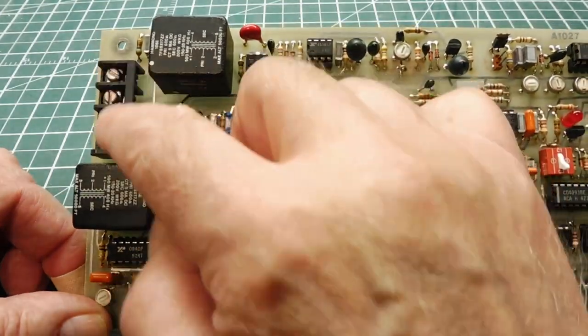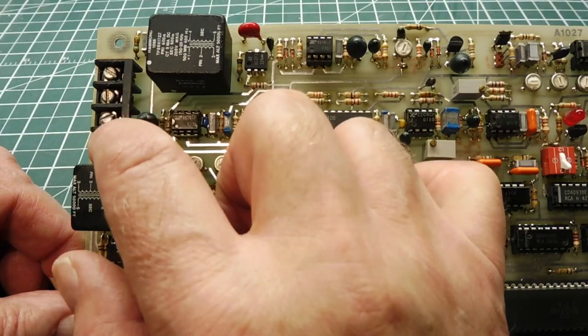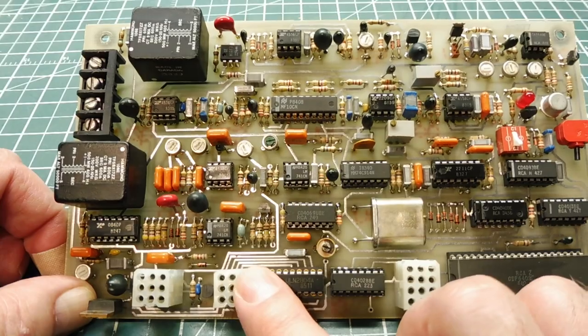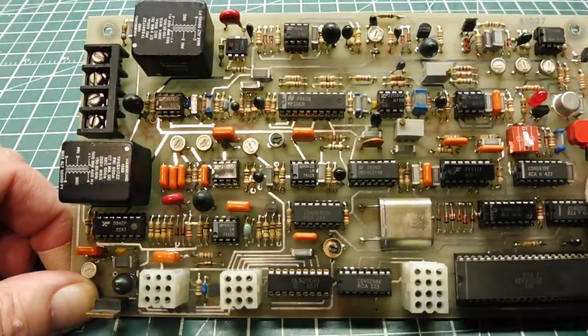Here's my input — my four wires. Here's VCC and ground and RS-485. So this is where the four wires come in. I bring everything into these connectors and everything here will interface, and I can send the data out to the LoRa radio.